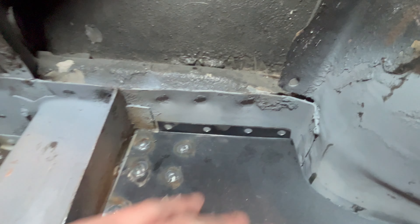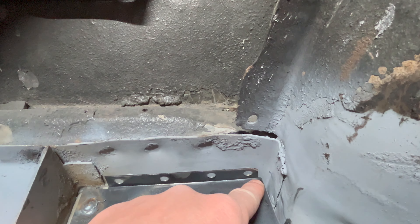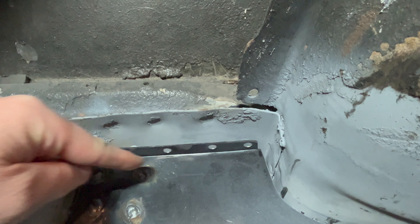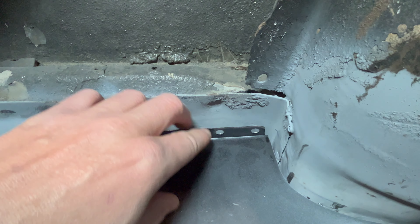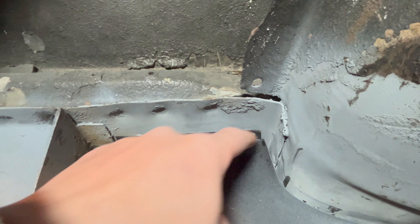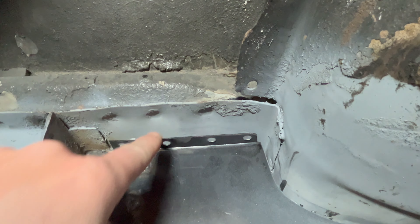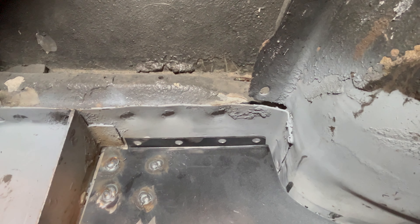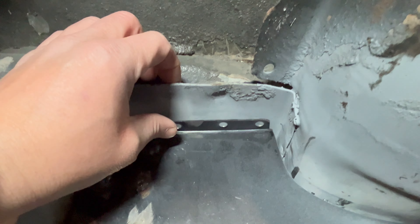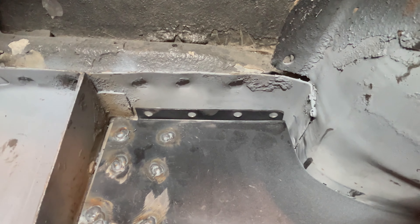It's going to be a little less support than I would want. So I think what I'm going to do here is a slightly different approach. I'm either going to cut it, move it over, and then fill in - which doesn't sound that appealing. Don't want to make like two seams to fill up a half inch gap. Or I might cut from here to here and then just create an L that goes underneath and welds to the floor. That would be the stronger solution. Again, not super critical. I'm probably overthinking it, but if this surprises you, you haven't watched enough of my channel.